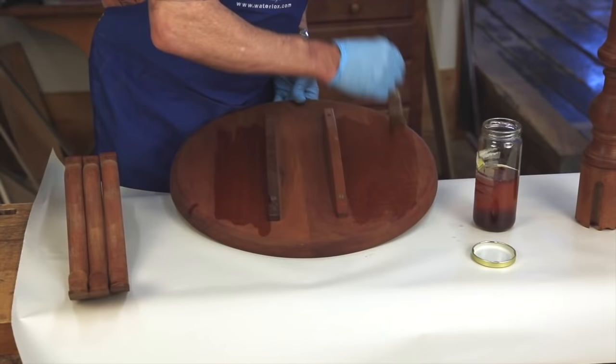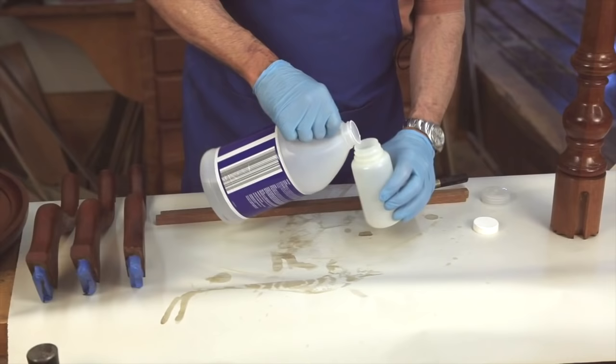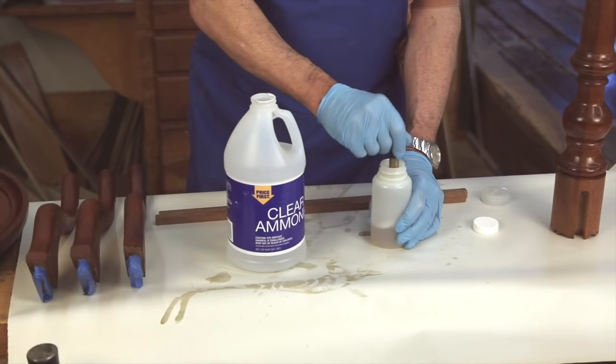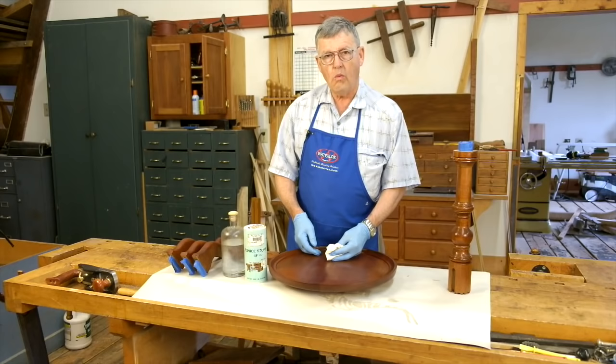You work shellac when brushing it with a full brush — move quickly and don't brush over things a lot. Work fast and evenly. The main thing is to not be too concerned if you have too much finish in some places; we'll correct all that in the next step. A great money-saving trick to wash your brush after spreading shellac is to take a little household ammonia, put the brush down in it, and work the ammonia in well. Then run cold water over it — it will remove all the shellac, leaving it cleaner than alcohol at a fraction of the cost.